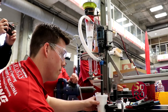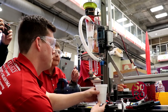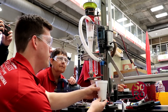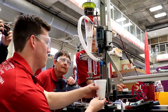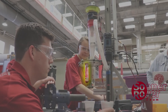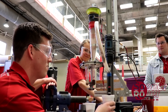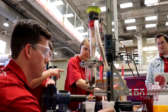The science package consists of a drill, vacuum, and carousel used to collect regolith samples. The drill agitates the regolith so it can be vacuumed up by the cyclonic separator. The regolith is deposited in one of four preloaded test tubes containing hydrogen peroxide and tested for organics by monitoring the reaction. No reaction between the sample and peroxide indicates no organics, while organics are indicated by an effervescent reaction. Between each sample site, the vacuum system is purged and the carousel rotates to the next tube.